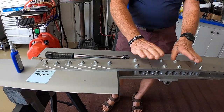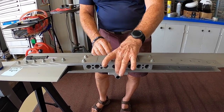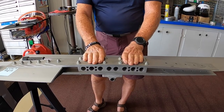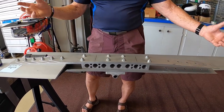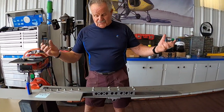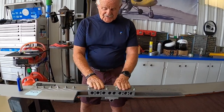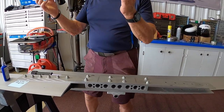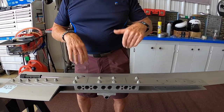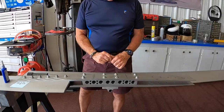When doing the shim selection for the towers on the rotor head, make sure you do that with no blades on — it's a lot easier. Some people completely assemble the rotor system first and then try to jockey everything around up on the rotor head. It's best to just take the hub up on the ladder, get your shims selected and checked, then bring the hub back down and assemble it to the blades.